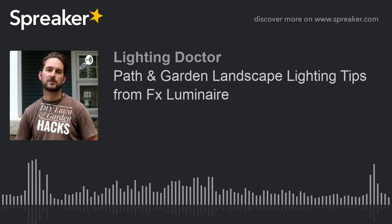We chose eight feet to get an even light throughout the walk. The height of the riser for the path lights does affect the spacing distance. We use a 12-inch riser on these path lights. If we were to use the 18-inch, we could probably space the path lights a little more as it's going to put out a little more light — probably 12 feet for the 18-inch riser would be perfect. This sidewalk is a little inconsistent with the rock and media intermixed, so it's a good call to stay on the safe side.